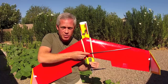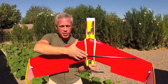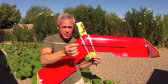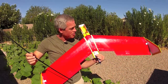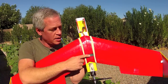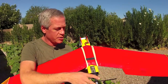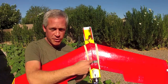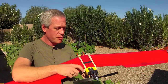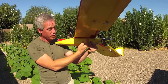The center of gravity should be right where the spar is or just forward of it. Structurally it's very sound laterally and also in the longitudinal axis due to the location of the spar. It also allows the use of just one spar, which is economical and keeps it simple. Because the CG is at a fixed location, just about any configuration of fuselage pod and cargo is acceptable as long as the CG falls right there. You can detach this wing and build any number of fuselage pods, moving them forward or aft to get the correct CG.